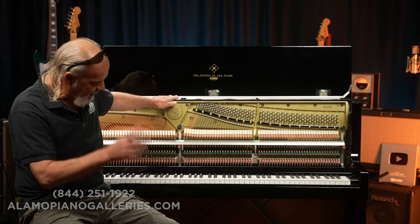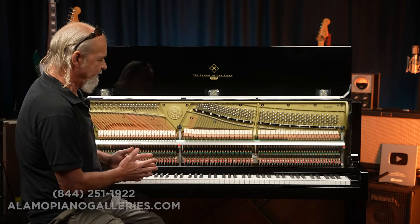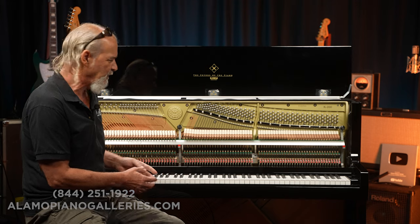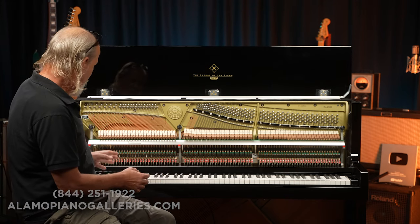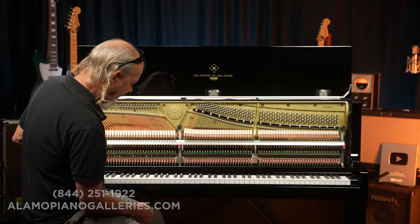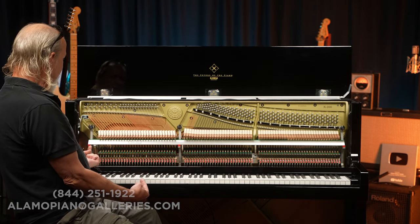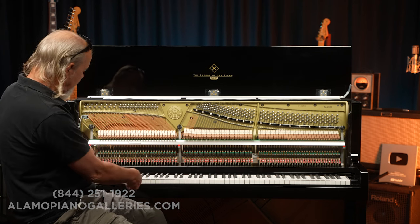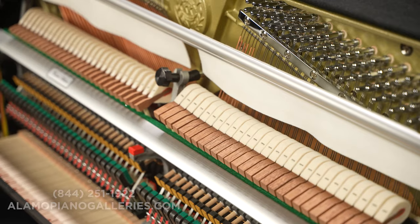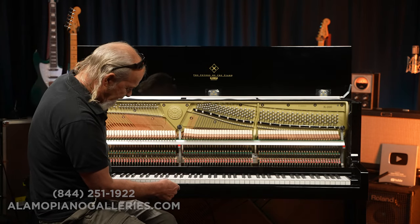This is the one pedal that does not work on a push rod. That's always been an annoying thing about upright pianos — people complain the pedals don't work or their pedals are broken. Really, it's very simple mechanical: it's just an arm that goes over. When you press down on the pedal, you have a downward motion which causes an upward motion. It's just a stick to a stick, and it makes the damper pedal — the soft pedal — bring the hammers closer to the strings so they're not moving as fast. On the other pedal, the sustain pedal, when you press on that, it's an arm to an arm.